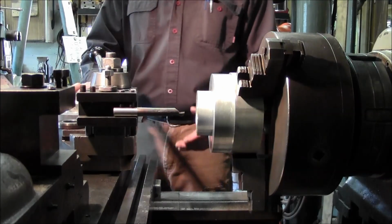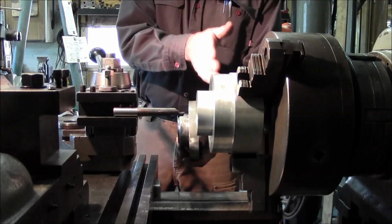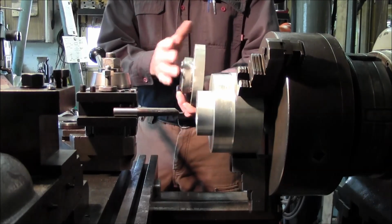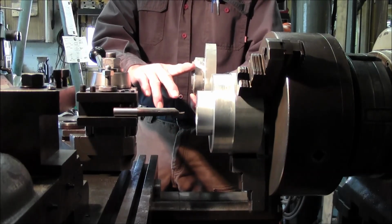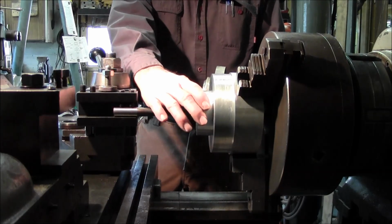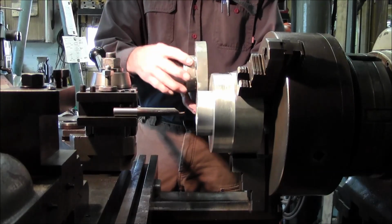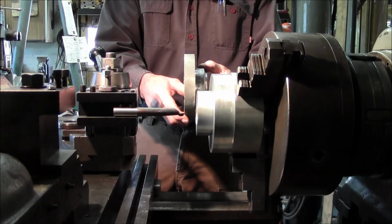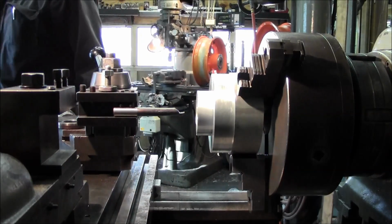It's going to be in farther than our part. That drill point goes in beyond this. We're going to be parting this part off right here in the machine. So we're going to completely do all the finished work on this outside, with maybe the exception of this angle here, because I want to leave this material here for when we turn it around to have something to chuck onto, and then indicate two different areas here so that we can prove that we're running completely concentric in the other direction. Alright, now I'm going to start whittling away on this bore here.